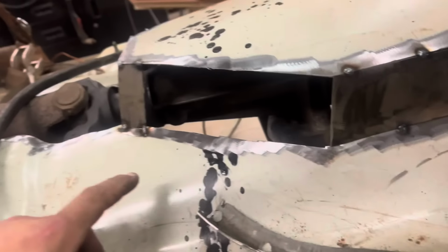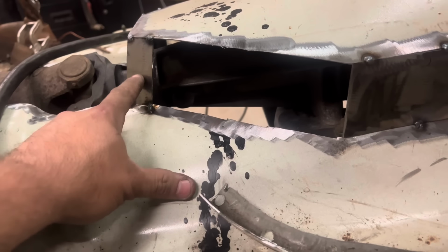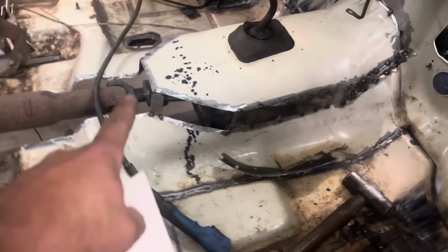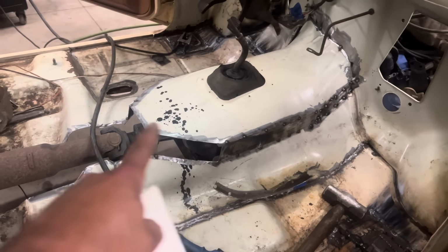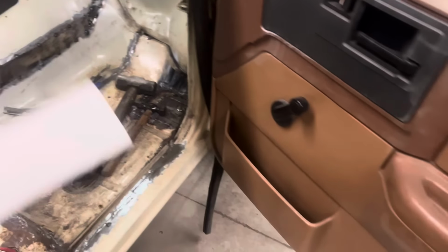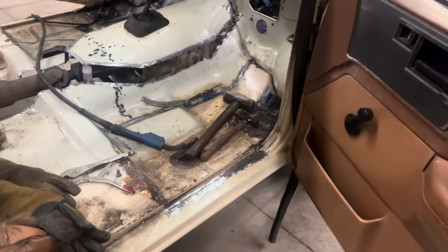This panel here, I'm fixing to cut it out. Once I get it cut out and ground and everything ready, I'm going to cut this piece back out, and then I'll just weld this in. That way, I done that so it wouldn't move, basically, like I told you a while ago. I just want to show y'all what we're doing. We just take that poster board, and I basically just took a tape measure, giving me a rough measurement, and come over here, cut it out a little bigger, and then keep coming back in trimming it until I get it fitting like I want.